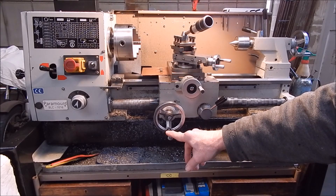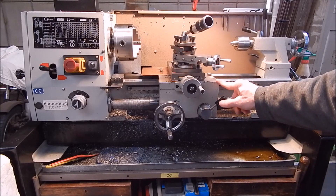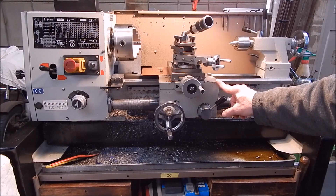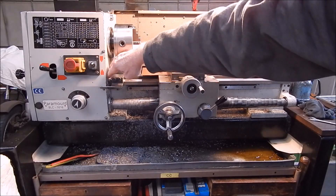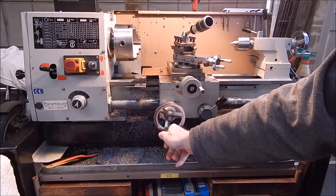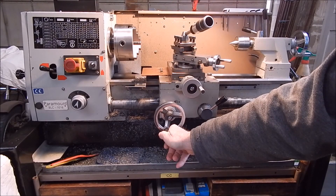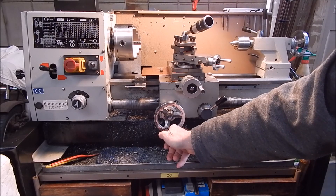It's essential for bottoming out jobs and stuff like this. The pity of it is that most Chinese lathes — in fact virtually every Chinese lathe I've ever seen — never has a carriage stop. They have a carriage lock quite often, but you don't get a carriage stop which sets the position that the carriage can go to. Some of the more upmarket small lathes like EMCO have aftermarket carriage stops, but if you've got a cheap Chinese lathe and you want a carriage stop, you're going to have to make one.